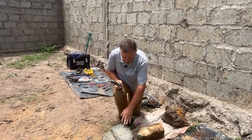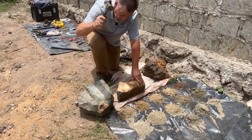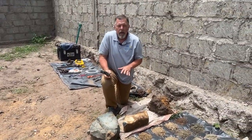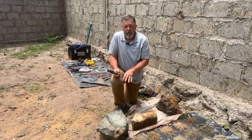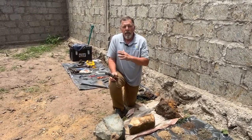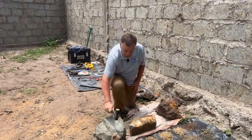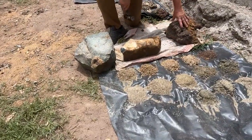Then of course you have the hardest, which is an igneous rock. We'll listen to the sound — you can just see the hammer fly up off of it. This is some of the hardest rock, and most drillers wouldn't even go through this. We're penetrating it somewhere — it depends on if we're on a fracture or not — but on the best side, about 50 minutes, up to about three hours to penetrate a meter on this type of rock.